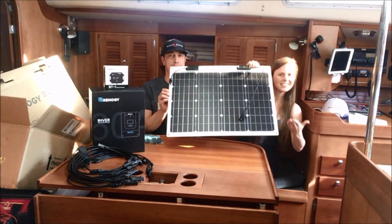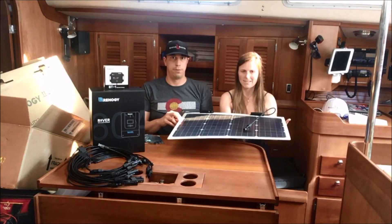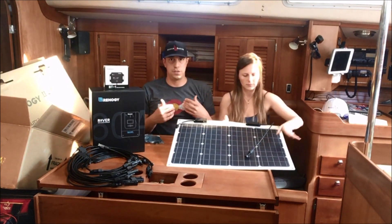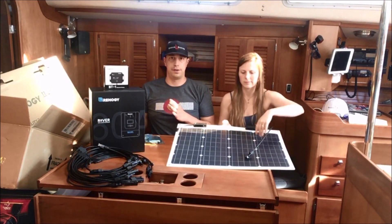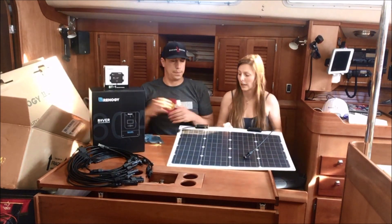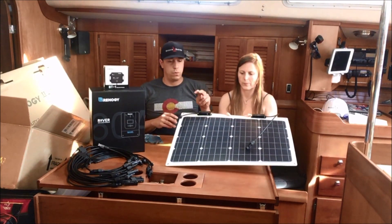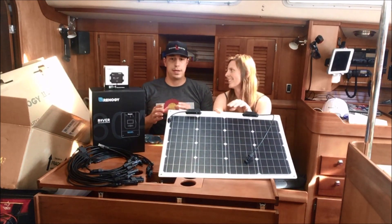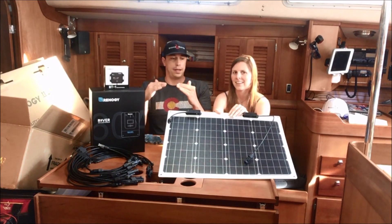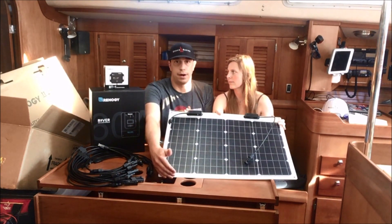It's not too heavy — only weighs a couple of pounds. We bought five of these individual panels for two different reasons. These are each 50 watts apiece, so together on our Bimini we're going to have 250 watts of solar. On our Dodger we have another 160-watt panel, which is about four times the size of this — it really goes throughout the whole thing. The reason we went with these panels for the Bimini is because of size and space; we didn't want them folding over the bars that support the Bimini. This was the maximum width we could fit between the bars.